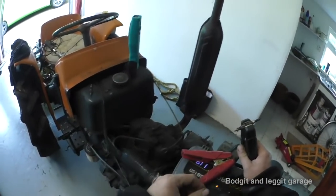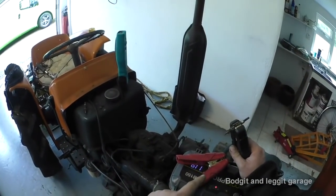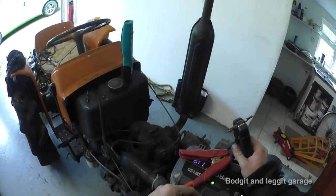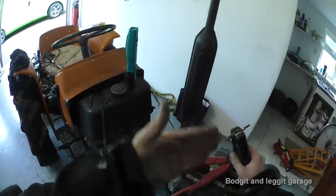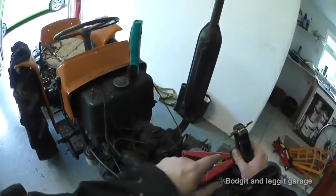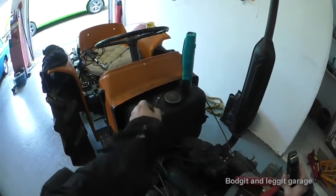Again, we're going to see if we can get heater plugs, because there's no harm. But if that was in a car, I'd be changing it. So even though we did the quick test with the test light to see if it wasn't shorted or anything, it still gives you a good indication to actually test them properly. There's loads of different ways you can test them, but I like taking them out, especially when they're as easy as this. Now, if they're difficult, okay, fair enough. But when they're as easy as this, to take them out and to physically see it glow, you might as well.